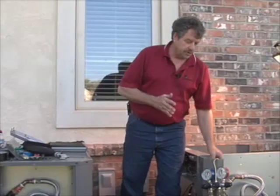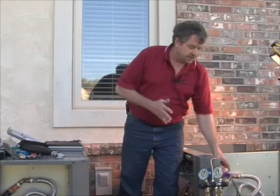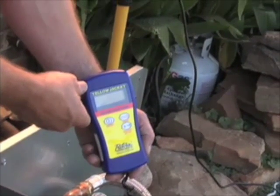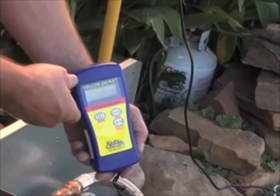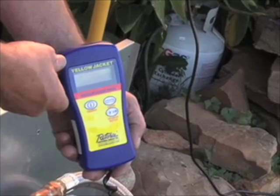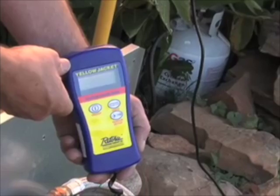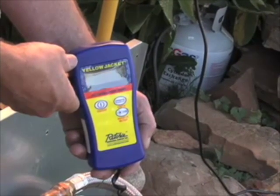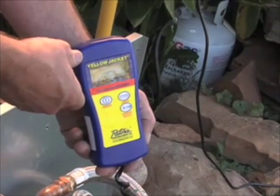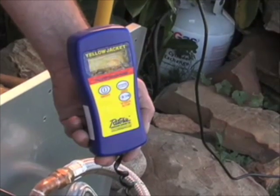One of the critical components when you're doing open surgery on a refrigerant system is to use a good digital vacuum gauge to make sure you're pulling down to a true deep micron vacuum. It's critical with R-410A systems and the POE oils. Don't just rely on your manifold gauges — remember they're not all that accurate unless you are frequently calibrating your manifolds.